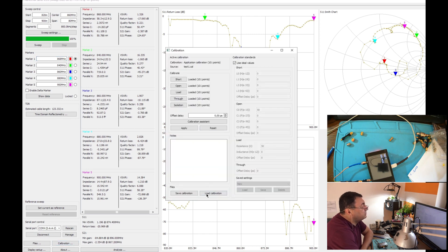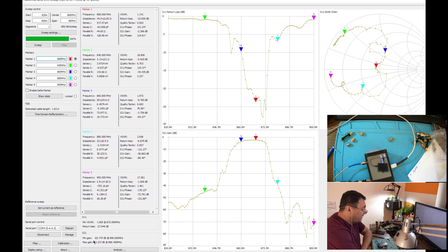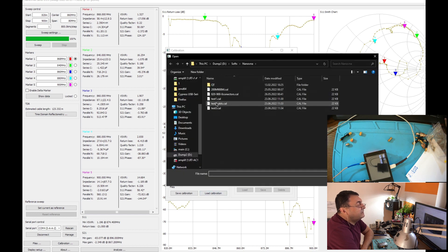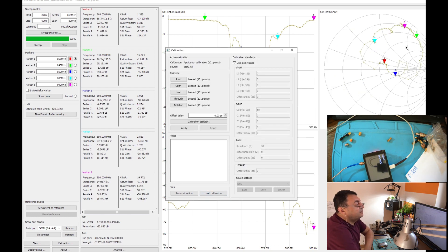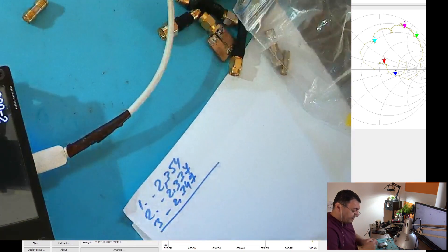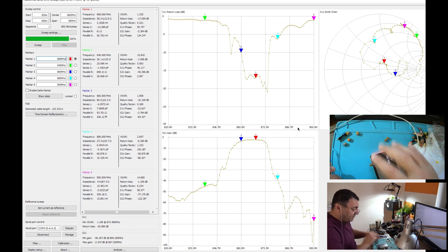The result with calibration one is minus 2.3. Now the second calibration was looking very good on the Smith chart — and look at that, it's like crazy: minus 2, very very close. Look at the Smith chart — there's such a huge difference. Test one shows impedance resistance at the ends of cables — interesting. Test number three is almost like number one. The numbers are minus 2.347, very close, but for the Smith chart I'd go for calibration two — through the wire with a load on port one.